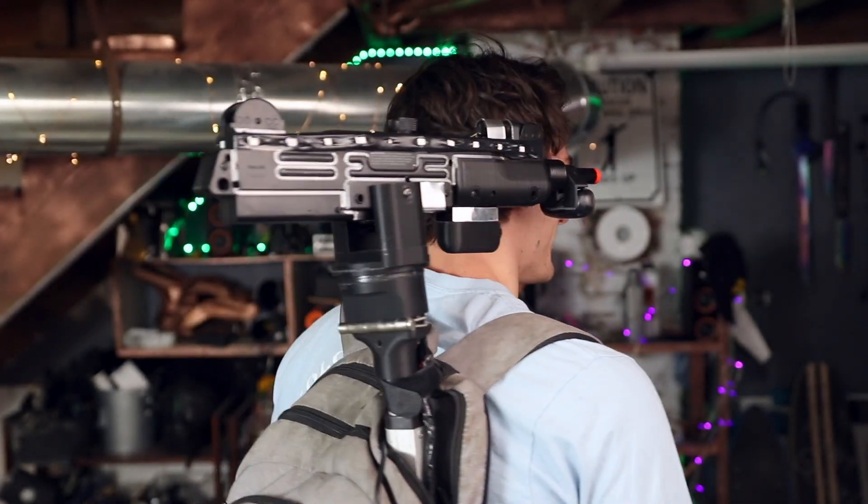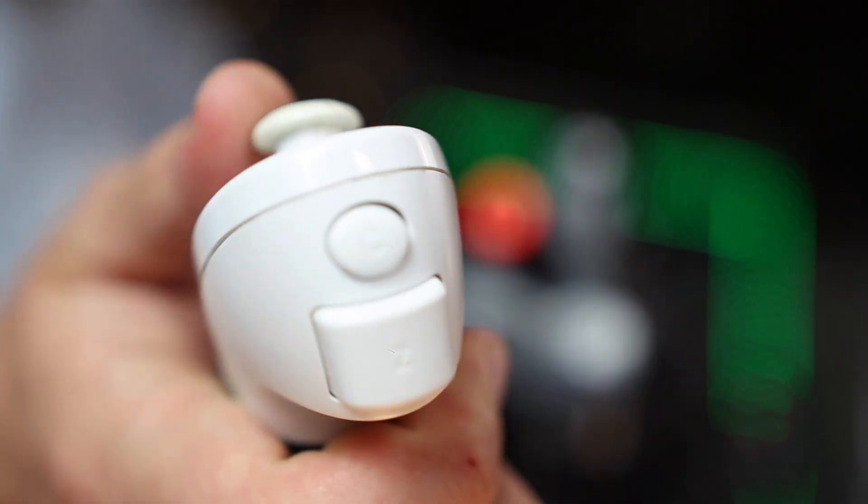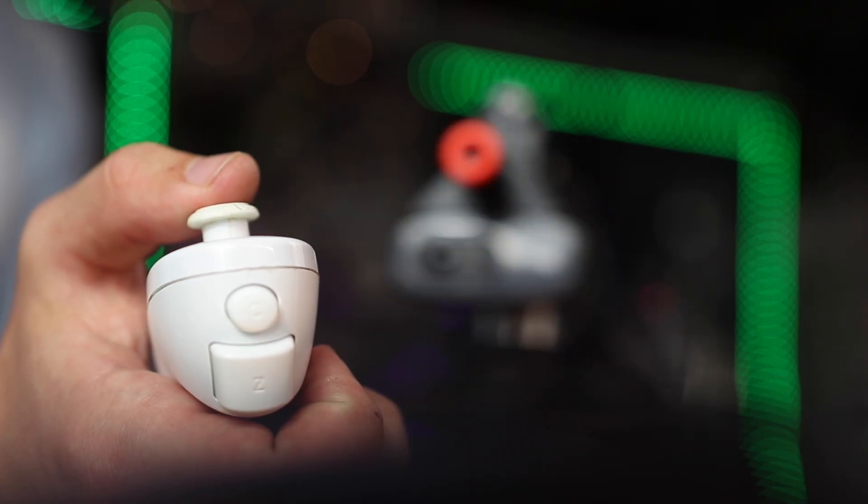So here's what we got. The blaster works by having two servos — the pan and the tilt — to drive it around: up, down, left, right. I thought it'd be funny to control it using a Wii nunchuck, because memes. Right now this is in manual mode — pretty simple. We just hijacked the joystick signal, so left moves left, right moves right, and we can do it all at once. You may have noticed the aiming laser on this — a standard five-milliwatt laser pointer. This helps a lot with aiming in manual mode, because you can't really aim down sights since it's on your shoulder. Like and subscribe.